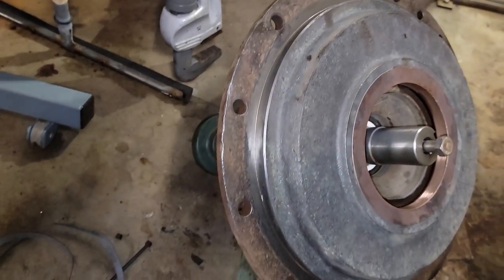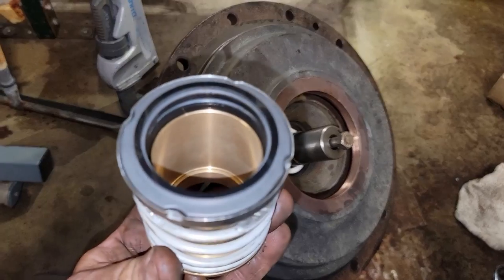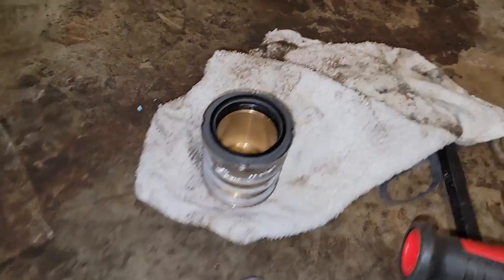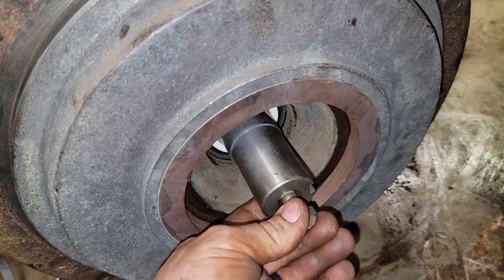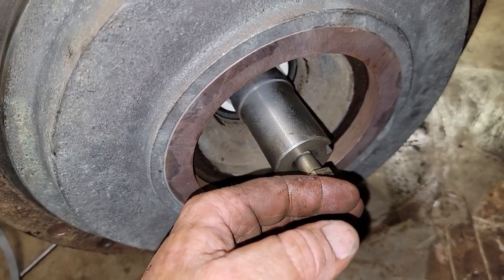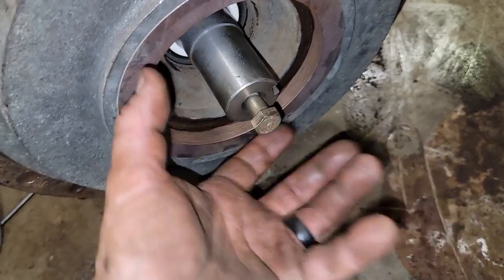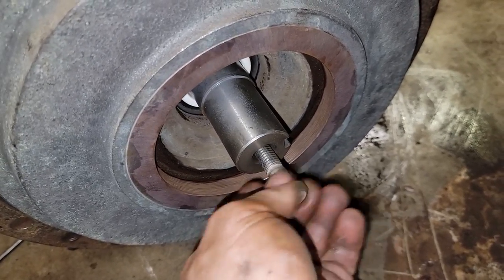The friction is on the black to the white, so as time goes on and crud gets down in there it eats away at it and causes abrasive problems — that's how it starts to leak. I've got to put this on horizontally so I'm going to lay this back down on the spindle and slide it on horizontally, then put on the brass afterwards. If you have problems getting that old spring mechanism out — it's all gummed up and won't slide — I cranked this bolt all the way in, then gently let it hit the floor. The weight hits against the threads without damaging anything; basically it's like a weighted sledgehammer and it pops down.